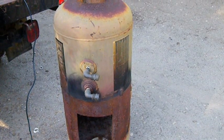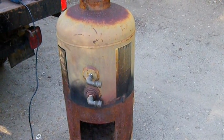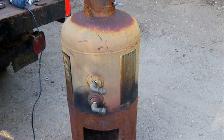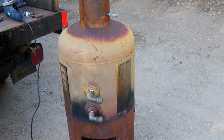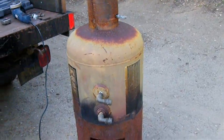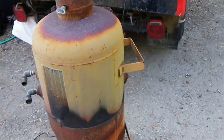And if that pump failed, the water in the coil would quickly boil off into steam and basically cause problems. If the pump failed and the water boiled out of the copper tube, the brass fittings would quickly melt and the whole thing would be done with. I had to replace a couple of melted fittings.